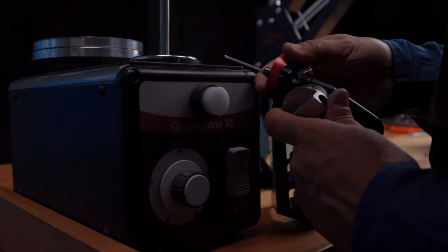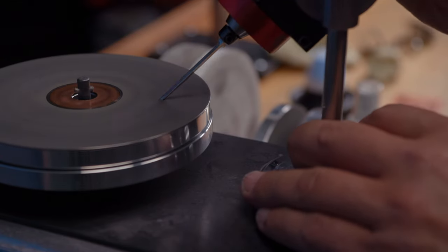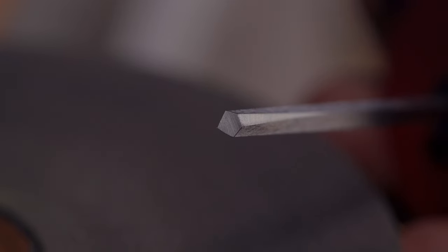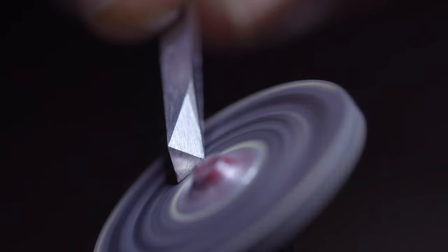If you're doing Power Assist engraving, then you'll probably also want to get a power sharpener, as it just makes it faster and more precise. My sharpener of choice is the GRS variable speed sharpening hone combined with the Apex sharpening system. This allows you to repeatedly get the same angles you need every time. What I use to maintain my gravers in between honing are these diamond wheels.